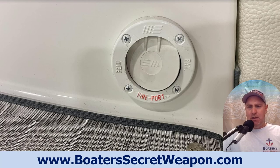Now, this is something you'll find on stern drives or inboards, and it's a little port. You may find that the red is kind of worn off. This is a brand new boat, and you can already see it starting to wear a little bit. So over time, you don't have that red. This is the fire port, and that's exactly what it is. If you have a fire on your boat in the engine compartment, you don't want to open it up and feed it a bunch of oxygen. You just want to put your fire extinguisher in there and spray and extinguish that fire without giving it additional oxygen.